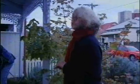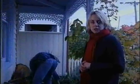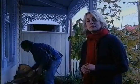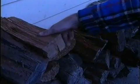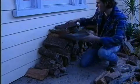You can dry your wood to an acceptable level simply by storing it in a dry, well-ventilated position. And buy it early in the year, even during the summer months when you can get some great savings. Stack it loosely with the end of the stack towards the prevailing winds for quicker drying. Oh, and split the larger pieces so more surface is exposed to the breeze. It can take up to 12 months for wood to dry properly, so always plan ahead.